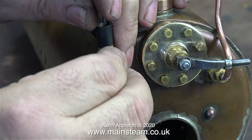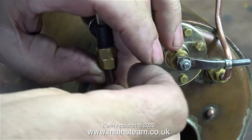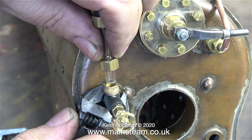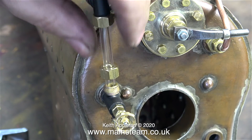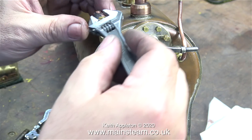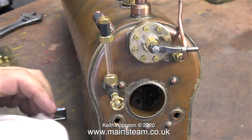Here's the process in full for fitting the glass tube: push it through the top fitting, put on the o-ring, then put on the nut. At this stage the top nut needs to be very slack. Then you fit the lower nut onto the piece of glass followed by pressing the lower o-ring into position. At this stage I recheck the alignment and in this clip I'm making a very small adjustment to the position of the lower part of the water gauge. When I was happy with it I tightened the nuts — they don't need to be tight, finger tight is normally sufficient. Usually when I fit the top nut I apply a very small amount of Loctite 542. Here I'm using a cloth to remove every trace of Loctite 542 from the bottom fitting.